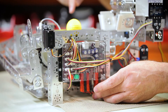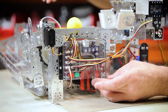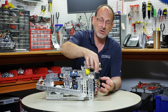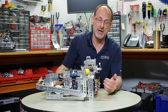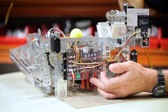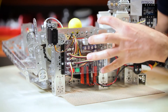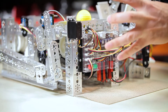With this model specifically, because I added several sensors to automate it, I had to be very aware of accessibility — where my wires would route, where I had access, and making sure the wires reached without interfering with the mechanism. I also had to make sure I had access to my programming port, because if I've got to turn my robot upside down or put my cord in a bind to program it, that becomes very inconvenient. So accessibility was a major consideration when mounting the Prism.